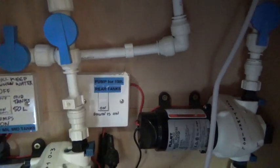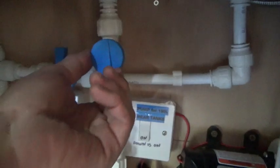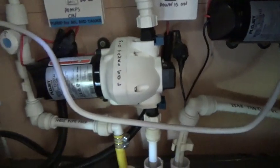I also need to make sure that the pressure doesn't flow back down through both of the pumps. And how I do that is I'm going to turn off each pump. So now the pressure of the water that's coming up through my hose pipe feed is going into my system and operating the system in the same way as the pumps are. But I need to make sure the water doesn't come back down both pumps and start filling up my tanks, and I turn them both off.